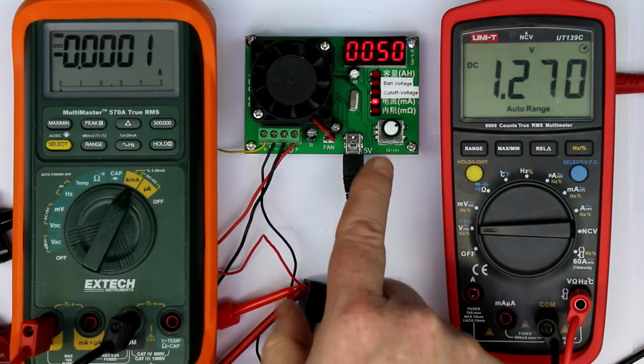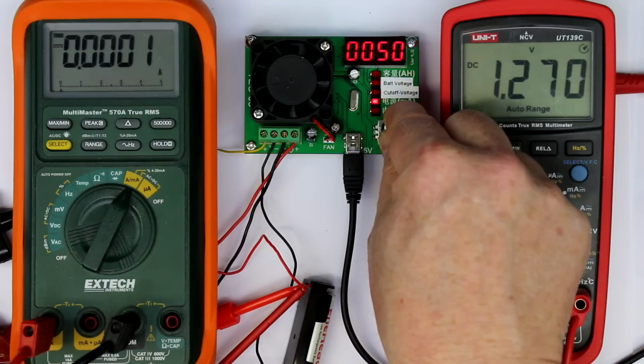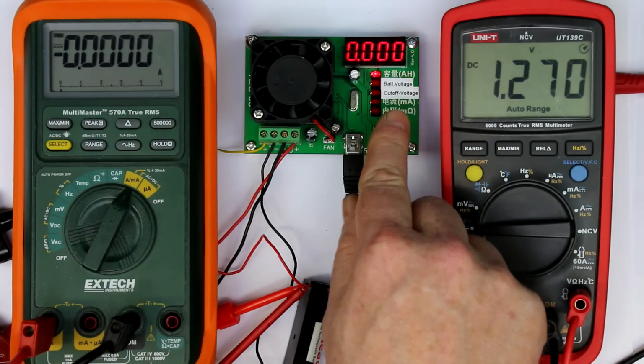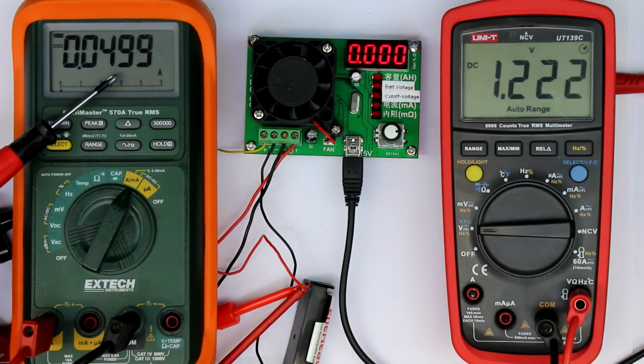We start with the lowest settable current of 50 milliamps. As you can see, I've connected here the single AA cell, 1.25 volts nickel metal hydride rechargeable. And okay, so let's start this thing. And what you can see, the current was slowly ramping up, and they claim in the description that they have a precise control loop. So it really seems that the microcontroller, and from time to time it goes down, so the control loop starts cyclically again, and it settles finally to very near 50 milliamps.